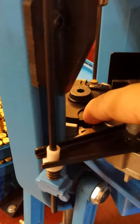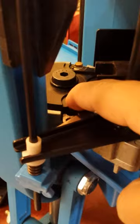Basically, inside here you've got your shell plate, which spins around. Station number two is where you get the primer inserted from the bottom by pushing forward on the machine — you can see the case gets inserted when you push forward on the handle.